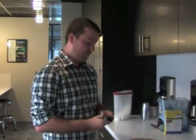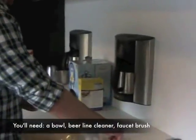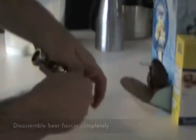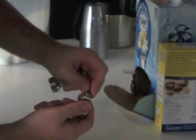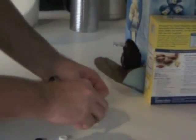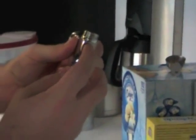For cleaning the faucet, you'll need the faucet, a bowl to set all the parts in, your faucet brush, and the cleaning solution. Take the faucet apart: remove the faucet handle, screw out the collar, then screw out the next part, making sure both washers come out so you can clean them thoroughly. Push the internal piece out of the faucet body as well.